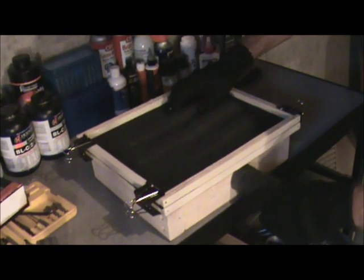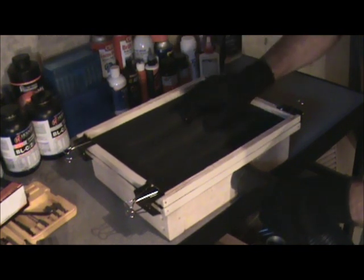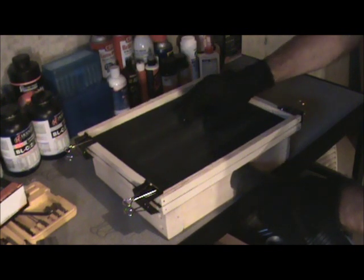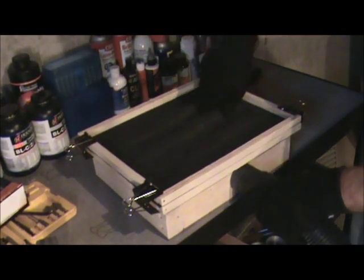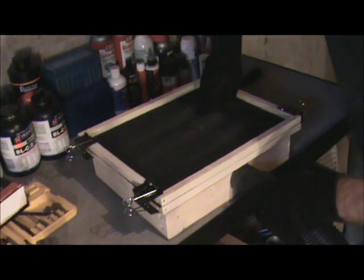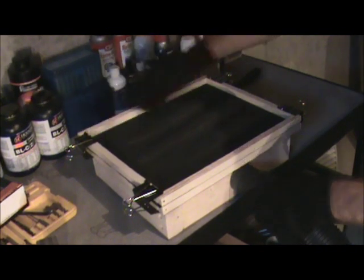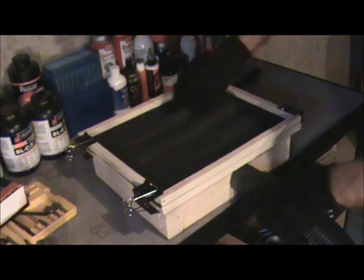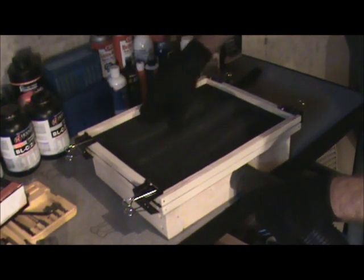You can also feel the temperature of the kydex through wool gloves, and that will tell you when it's okay to take the suction off. While the kydex is still warm it helps to work some of that remaining air out of the edge of the blades. If needed after this is done, you can easily take a heat gun and go back around the edges and work the rest of that air out.